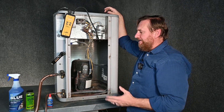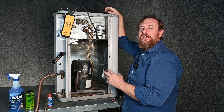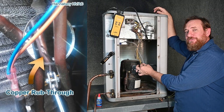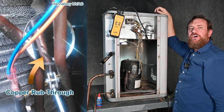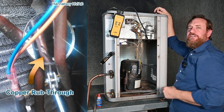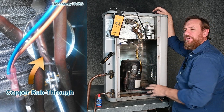So once we cover that, let's see what other things we find. We're looking at wiring — here's all of our wires that come down to the compressor. But a lot of systems have extra wires and sensors in this equipment, and one of the problems is these wires will be rubbing up against some of the copper tubing. It's crazy to think, but it happens — the insulation on these wires will literally put a hole through that harder copper. Just from vibrations, it will put a hole straight through that copper piping. So I always want to check to make sure all of our wires are free and clear. Anytime I'm doing preventive maintenance on my customers' units, I always take that top off and make sure none of these wires are rubbing anywhere in the system.